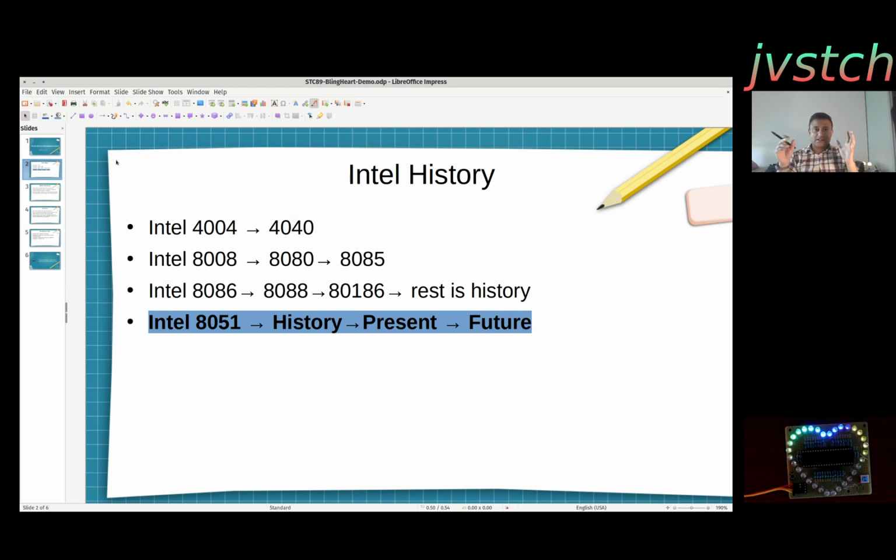But during that time, after the 8085, there is a gap to optimize the 8-bit market, to produce something so cost effective that it can be substituted wherever this Z80 and all these input peripheral controllers or any automation kind of market. So that's when Intel created the 8051. I think the original 8051 came with some RAM and also some UV erasable flash in one single chip. So all you need is one crystal, two capacitors, maybe a reset circuitry, I don't remember, for the original 8051. That's the only thing you need to run a full program using the 8051.